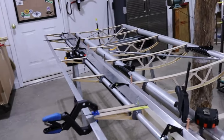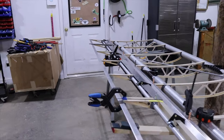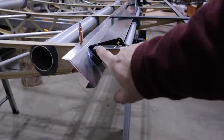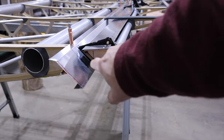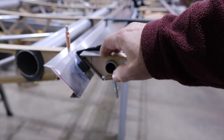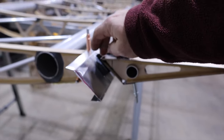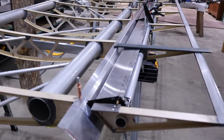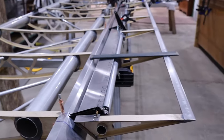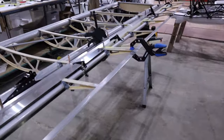The only reason I had any concern that things might be a little different is because I'm doing Steve Henry's aileron mod, which I love the idea of. What it does is it takes what would normally be the bullnose - I'll show you on the flap in a minute - cuts it off and makes a sharper point. The idea is that when this is perfectly lined up with the bottom of the wing and you rotate the aircraft, once it gets down in the airflow the wind catches it and gives you a little boost, making your ailerons more responsive.